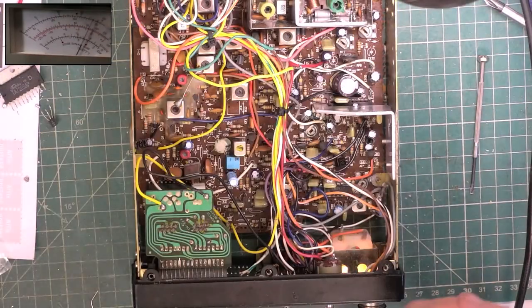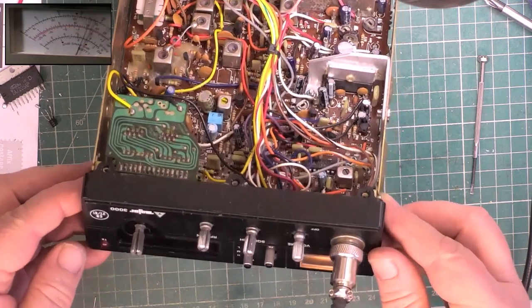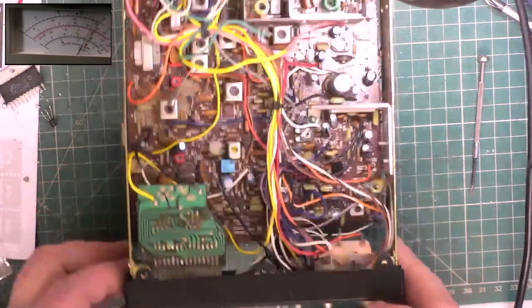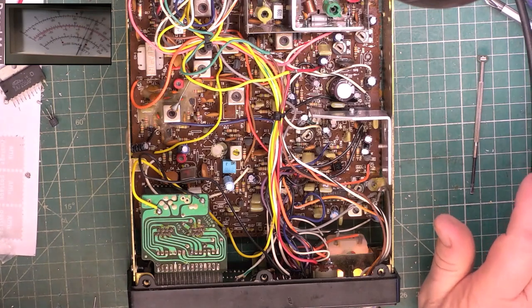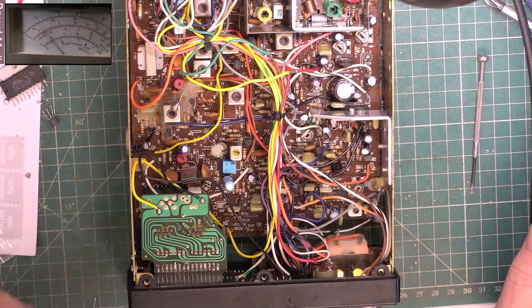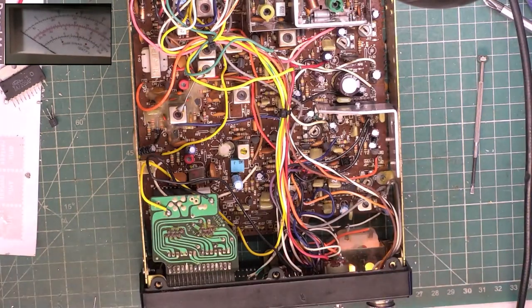So to recap, we'd had to change the TA7205 because putting an input onto that only got a low audio output. Changing about nine capacitors in the audio side, two were faulty. So was it that that pushed it over? Or then we find that ALC transistor's open circuit, blown apart because somebody's put volts up the mic thing? I don't know.